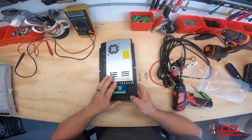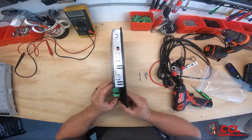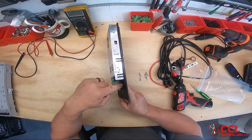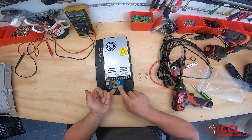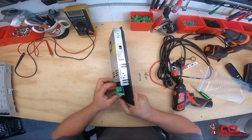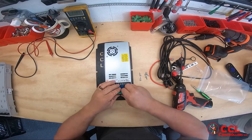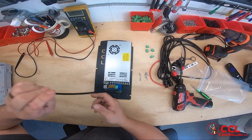Now what I'm not showing you in this build — because I don't have it — is that there's going to be a spacer and a bolt for that little hole. They didn't come in. We've ordered a bunch of stuff and with everything in Texas, we've had a lot of shipping delays, but there'll be a spacer with a bolt and nut to go through here. Technically you probably don't need it — the board's pretty solid — but if you push on it you could break the board off. Basically there'll be a spacer and you just put the bolt in, slide the spacer in, and tighten it up. Pretty self-explanatory. You get a couple zip ties and you only need a couple — put the zip tie through this hole here.